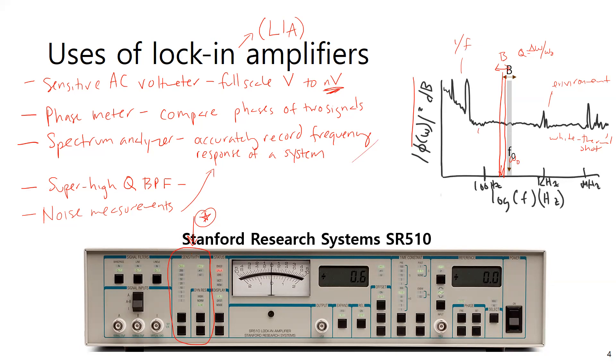It's very important to have the sensitivity at the correct setting. If you have this set to detect nanovolt signals and you're providing something on the order of volts, you're going to damage this instrument. The status indicator has an overload light — if that light goes on, remove the source right away. This isn't an instrument you want to play with blindly; do it in an informed way knowing you won't break the setup.